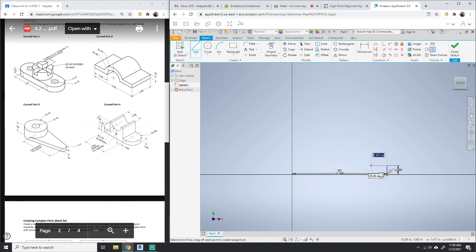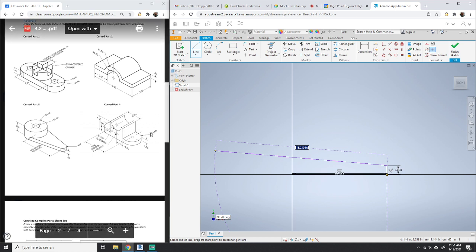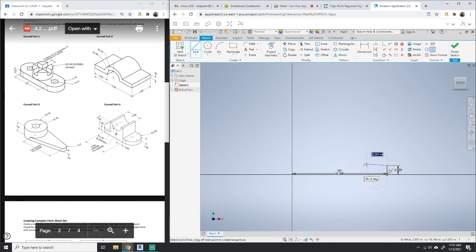And then we're going to come back over. We have to go, it's going to be 2 inches just to the hole center. We have to do a little bit of math here. From the center of the part to the outside edge on this one side, that's 2 inches. There's a radius of 2. The whole thing's 10. So it ends up being about an inch gap in here until we have to go straight up on this one side. So let's just say we go 3 inches over. I think I'm doing the math right. If I'm not, I'm going to see it really fast.